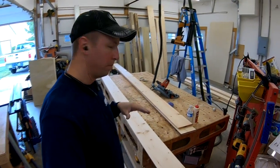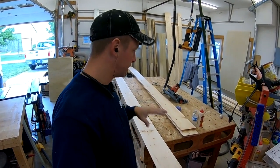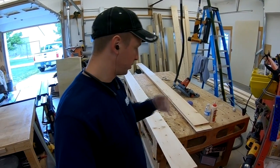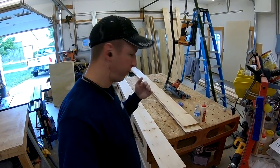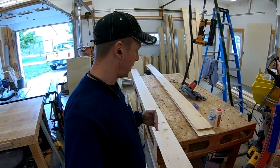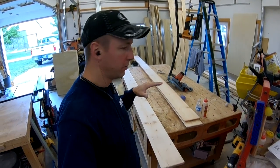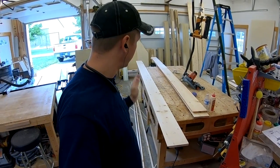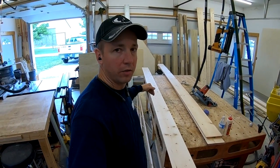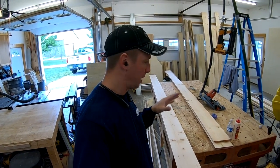In this video I'm going to miter fold four beams, but the first thing I need to do is get the bottom part of the beam, which will have a bevel on both sides. What I did here first was make a long rip with the track saw, which gave me a straight edge. Most of these boards had at least a quarter inch, if not three-eighths of an inch crown. Getting rid of that crown and giving me a straight edge is the first step in success whenever you're going to miter fold with tape.